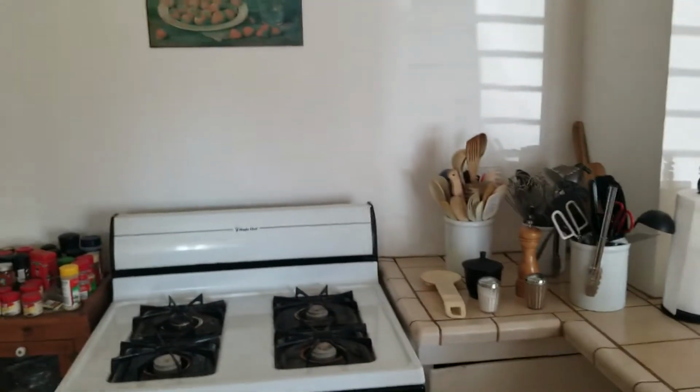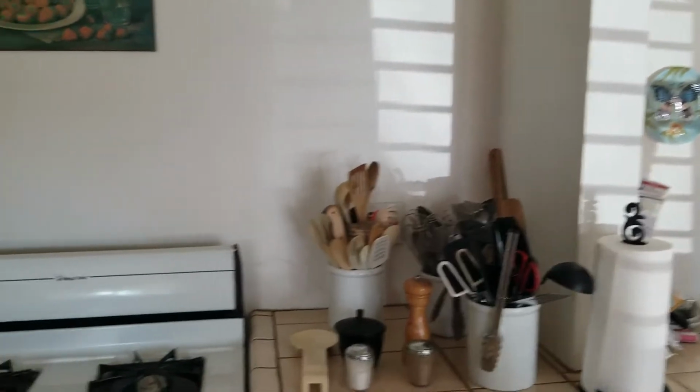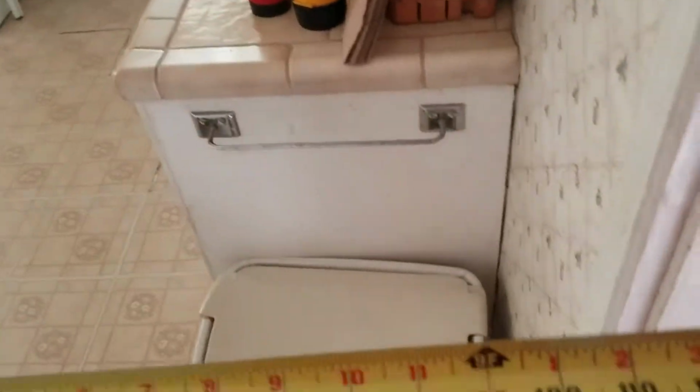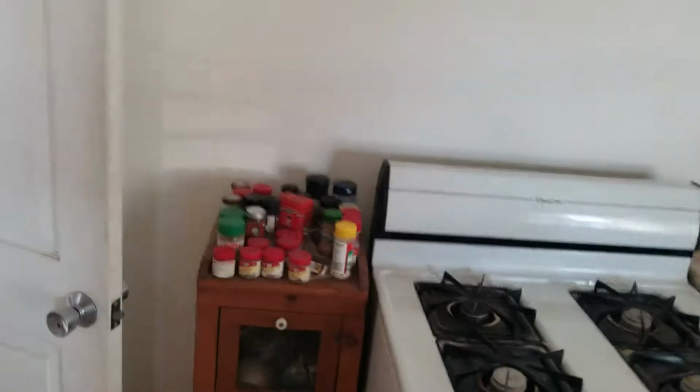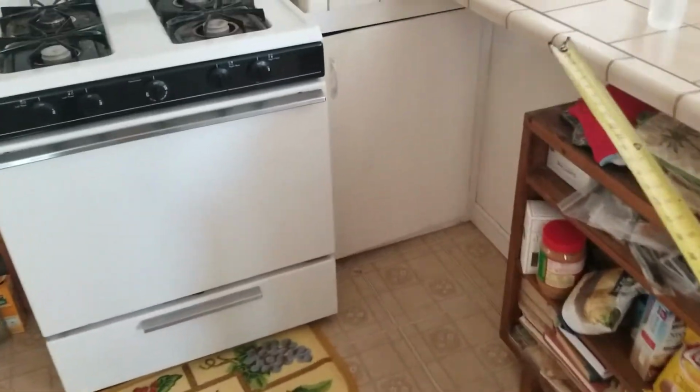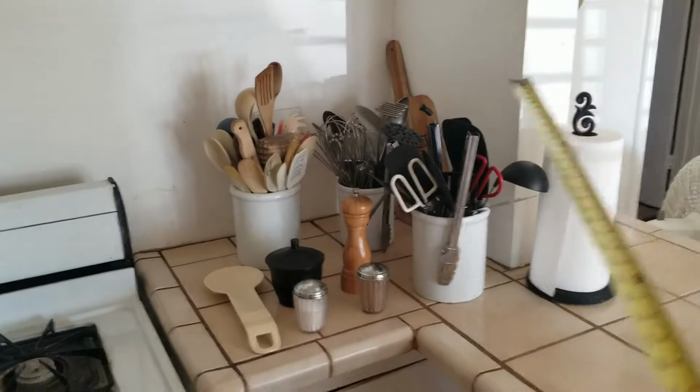So this is Paul, and I'll give you the rough dimensions. On this wall right here, from this wall to that opening, to this back wall here, you're looking at about 112, 113 inches. That would make this wall here about 112, 113 inches less our door. We're going to stick with a 32-inch door here. So 32 inches from that 112 is our wall space. It's possible that this wing wall may go, and then we've got a more continuous space to work with.